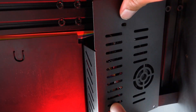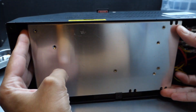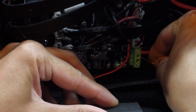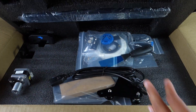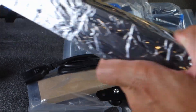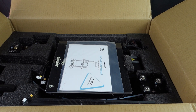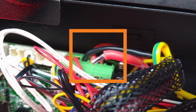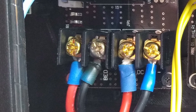While the Ender 3 is still easy to open up, you do have to be careful when putting the panel back on. Since the CR10V3 has a separate case for the electronics, repairs are easier since you can simply remove that portion. I hope this video illustrates how important it is to check your machines once you get them, since you never know how seriously a company has taken safety into account. As someone who has bought a device which didn't have thermal runaway enabled, I can say just how serious of an issue this could be. In future, I would like to see companies stop using tinned wires in their terminal connections, since this represents a significant safety issue and is definitely something I will be watching for.